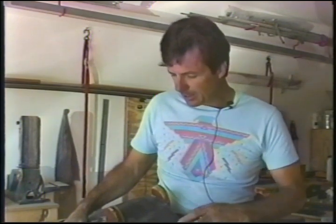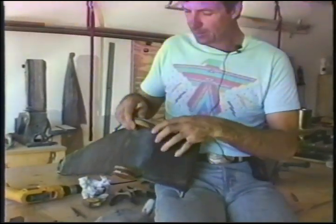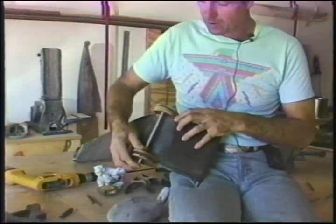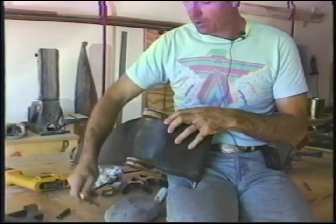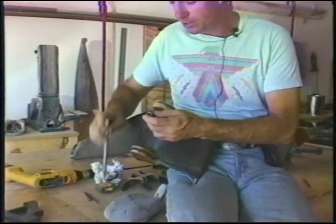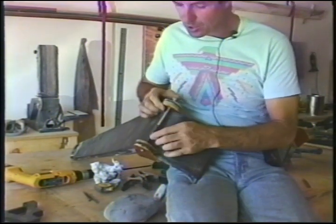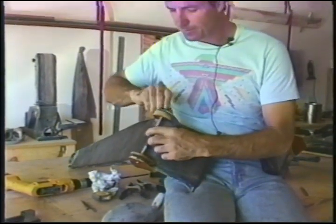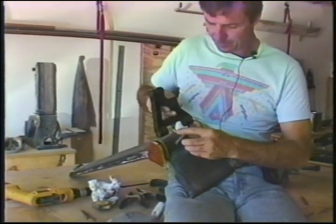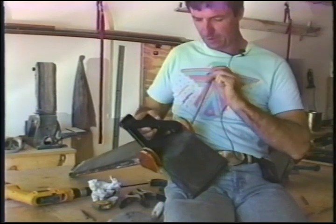Here on the tabs for the last important structural consideration on this gear leg. Make your bolt, make sure it goes through just fine. And you now have your bushing, 3/8 ID, half-inch OD, 2.9 inches in length, chrome moly steel. And make sure that it fits okay on the bolt. What we're going to do here, I'm going to show you how all this stuff relates. I'll come from the other side here again.